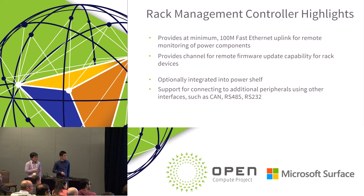My question is, is the 48 volt hot swappable? Well, under voltage, yes, but also under current? So if there is a load on, you can disconnect it? Yes, that's how it's defined. Even if you are running a node, you should be able to disconnect it.